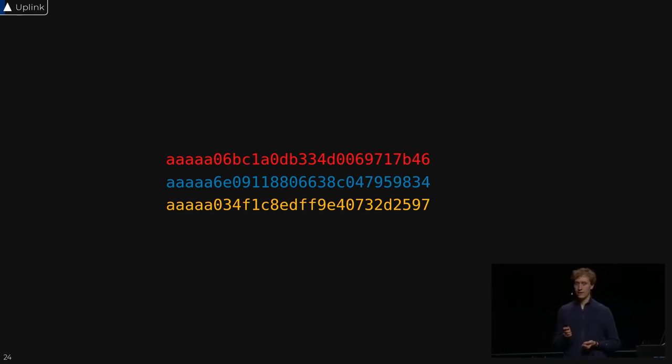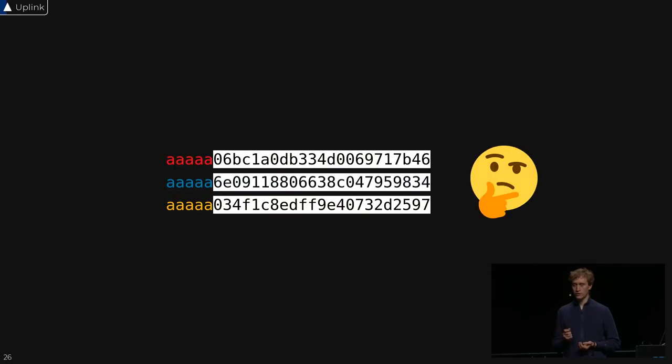The one thing they have in common is this preamble here. But everything else appears to be completely uncorrelated. That's what I thought at first. But eventually, it turned out that this is convolutional coding. I guess if you're a coding person, it's enough for me to tell you that this is a 5,7 convolutional code. If not, you probably don't know what these words even mean.